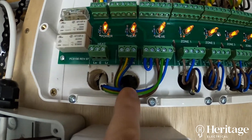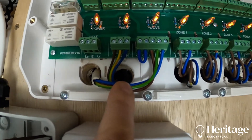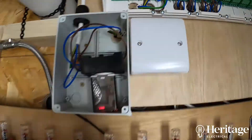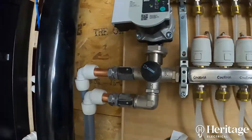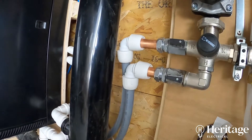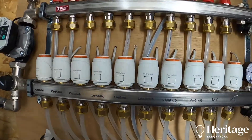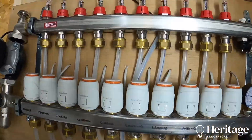We've got a supply here for a zone valve, but in this case we haven't got a zone valve. The zone valve would normally be on the plumbing coming into the manifold, but as we've got all the actuators there's no need for an additional zone valve.